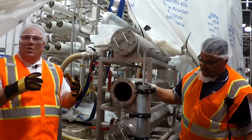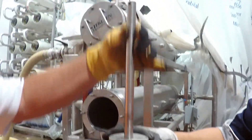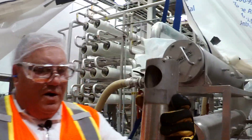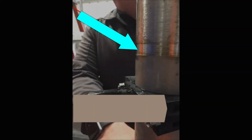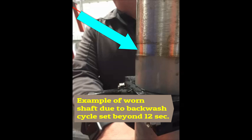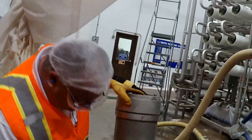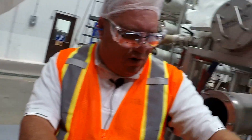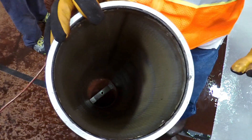These are the suction nozzles where it actually sucks the dirt off the screen. What we want to check here is to make sure that this bar is okay — which it looks good. On the other end, some scratches are normal. You want to make sure there's no groove cut, which there's not. Check that none of the screen is torn off. Everything looks good.